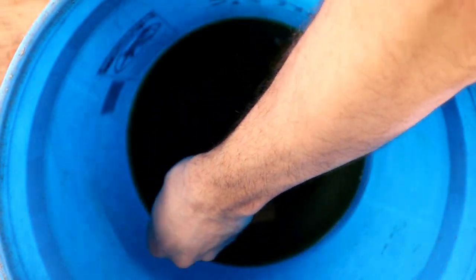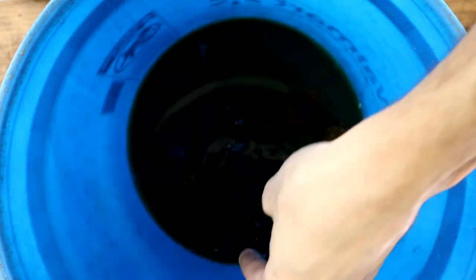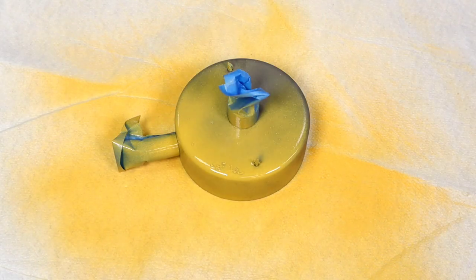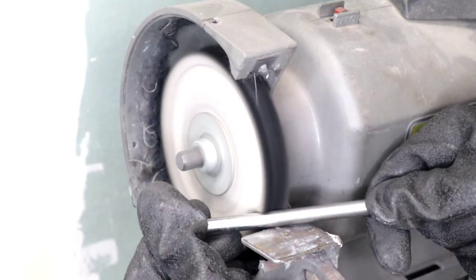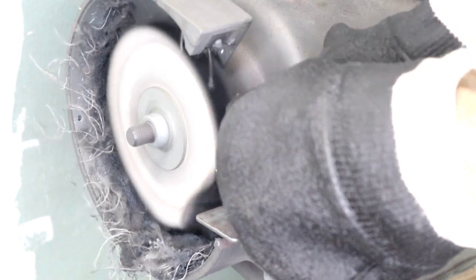Before evaluating the remaining pieces, I soaked all the metal in Evap-O-Rust for four hours. On a budget or for large projects like a front-end rebuild on a vintage car, I'll also use apple cider vinegar, and in a pinch, regular vinegar — but remember, these solutions are also used to rust things and make them look vintage, so you'll need to neutralize them. For the housing, use a sandable primer for light scratches and a filler for pitting. We lucked out this time, so it was straight to the vintage yellow — three light coats for the desired look. The extension rod turned out to be in by far the worst shape, with deep rust pitting especially in the lower end. A soft wheel is great for getting the fibers into the bottom of those pits to help blend it in.